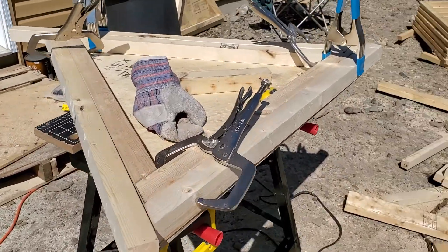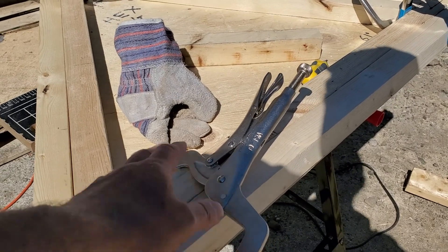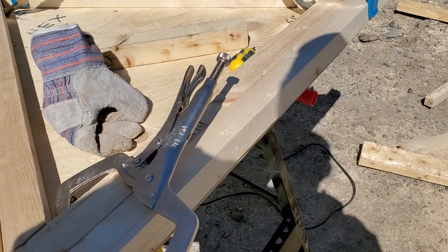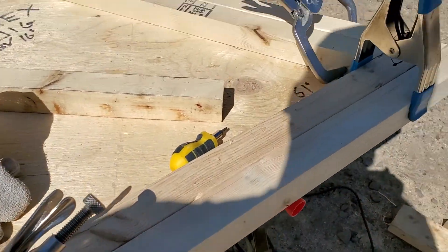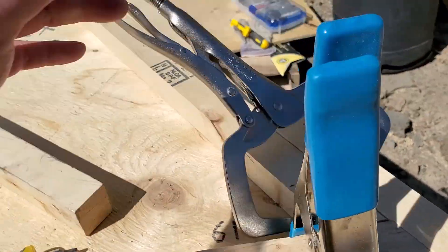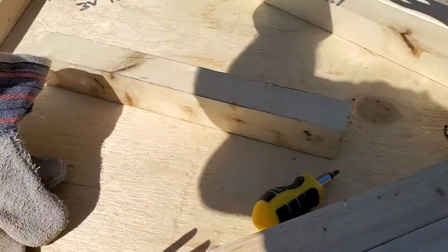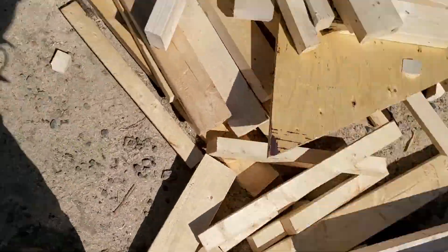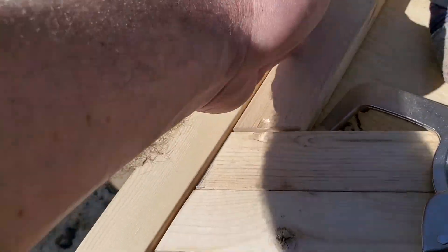Here's how I do this on the jig, which was the point of this video. You should have at least three vice grips and three clamps. Canadian Tire only had two when I went to buy them, so I've been making do. What I'll do is start them, clamp here, put a screw in, and then move the clamp over. These are C struts going up to the hub — this is my B strut length. When I get them square like that, I'll lay them out here, take the angle, and lay it nice and tight against the jig.